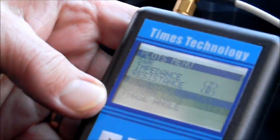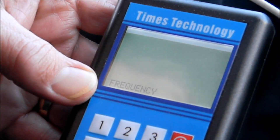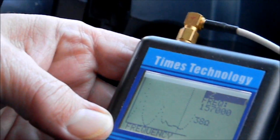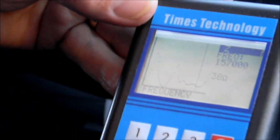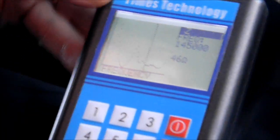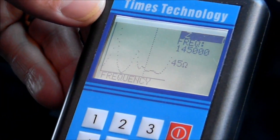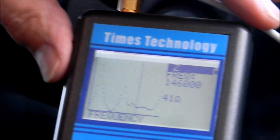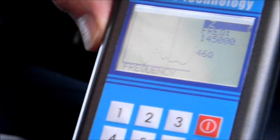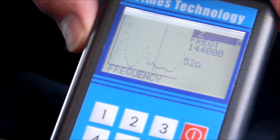Let's see what else it does. Here's our impedance — let's check this out. Scrolling back over to about 146 megahertz, it says about 41 to 46 ohms. At 145-146 megahertz it says 41 ohms. It looks like it's rising slightly — at 144 megahertz it says 52 ohms.